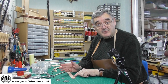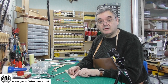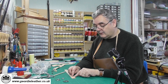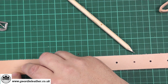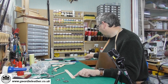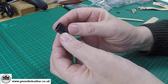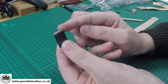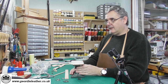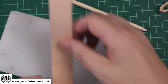There are various methods for making slots for belts and other hardware. You can buy a really expensive slot cutting tool, or you can do it by hand by punching a hole at either end and then cutting out the leather between those two holes — that requires a bit of skill. The alternative method is to use a simple leather cutting die. A leather cutting die is basically a piece of steel bent to the shape you want with the edge ground to a sharp edge. I'll use my trusty anvil and we'll cut our slot in the belt.